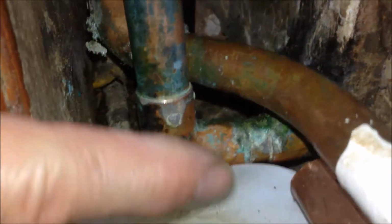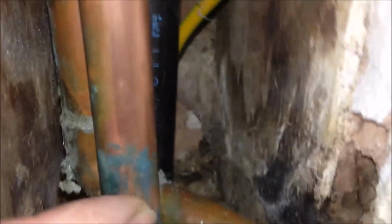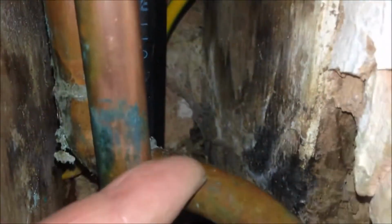So now you can see I just moved this behind that pipe. You can see now it's out. So I should have enough space to cut with this standard pipe cutter. I don't know where I'm going to need to cut it, but it's safe to just cut the lowest part so that I can clear here. I can bend the copper pipe to a shape. So I will cut as lowest as possible around here.